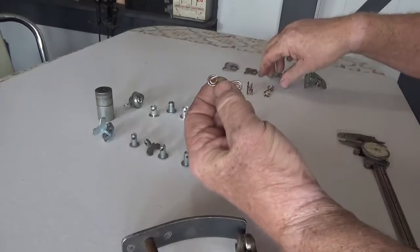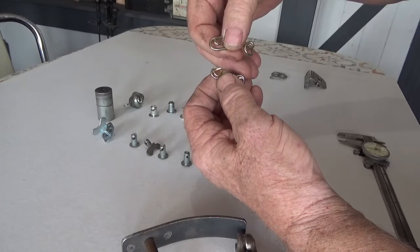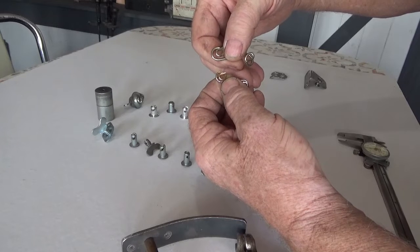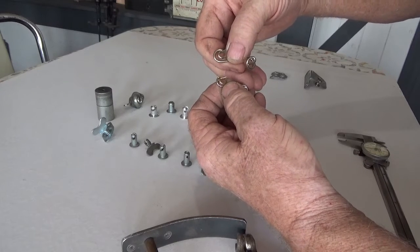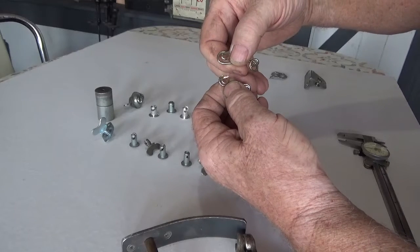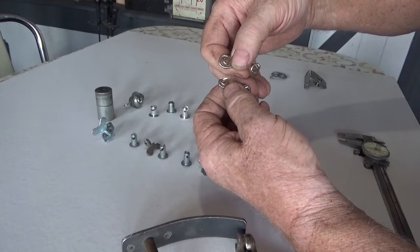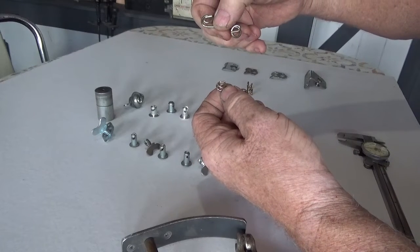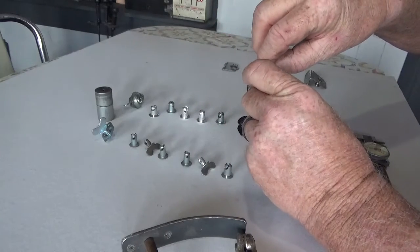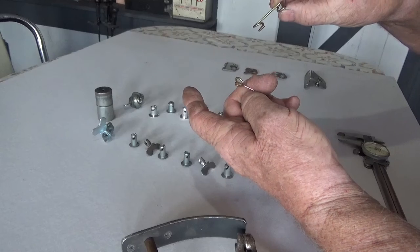If you can see the difference in these springs — the top one's a dash-six, the bottom one's a dash-five. The dash-six's got a little heavier wire. They just last longer and hold up better in race applications when you're mounting bigger panels and stuff like that. When I worked at Undercover, when I first went there, we used like a dash-four fastener to hold the dash covers in — it was a real tiny thing, real hard to get set, but nice if you needed to get the dash cover off. One inch between centers versus one and three-eighths between centers. I typically try to stick to the number six stuff where I can. They make different heights here, but that one there is about three-eighths tall — that works for just about everything.